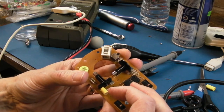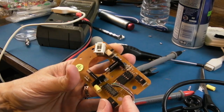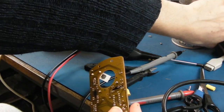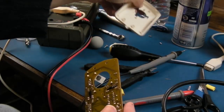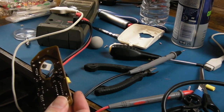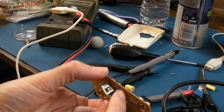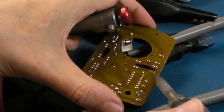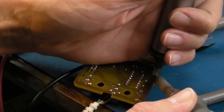And this is the thing, I might need to relocate that resistor actually, because if that resistor wasn't in the way, this would be a lot easier. I mean, in theory, there might be enough space to mount the resistor on the underside in here. Yeah, if you look at the standoffs here, there might just be enough. Hang on, the component just shot off onto my leg there. Oh, it's a screw. Yeah, I lost a screw for a minute. Yeah, that resistor, it may just fit under here. Let's just relocate that resistor actually, let's just try that. It just means that LED is going to fit lower down and be more in line with where it needs to be, I think.